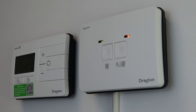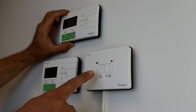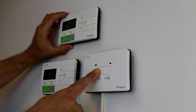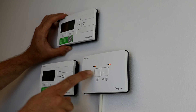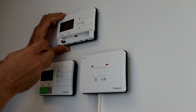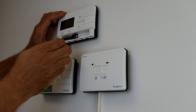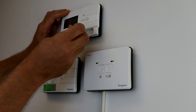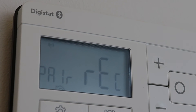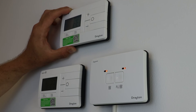The left-hand LED will either be off or solid green depending on whether there is a call for heat on the first thermostat. The right-hand LED is solid amber, indicating that there isn't a device paired to it. The second thermostat now needs to be paired — press and hold the left-hand button on the receiver until both LEDs start alternating between green and amber again. At this point insert the batteries into the second thermostat and it will begin to scan. After a few seconds the thermostat will confirm that pairing has been successful.